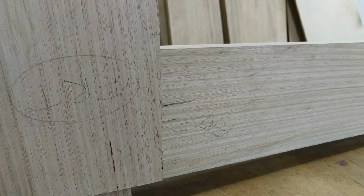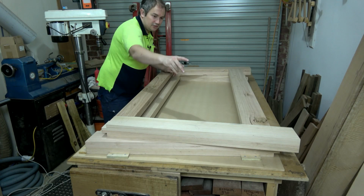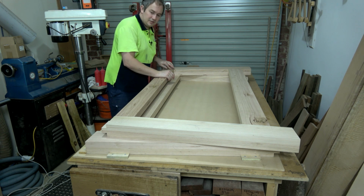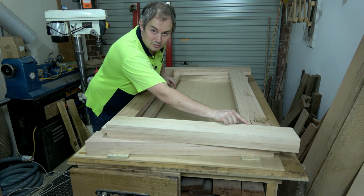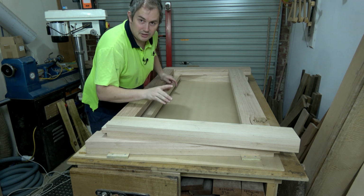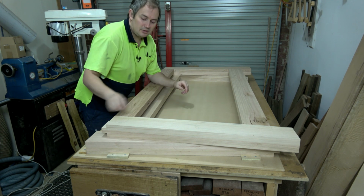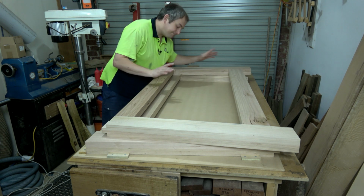But when you connect all 4 of them, you now need to turn 360 degrees. And so if this one is 90 degrees, this one is 90 degrees, this one is 90 degrees, and this one's 91 degrees, you're going to get a gap everywhere, because you have to account for that extra 1 degree somewhere. And so that'll open up gaps on the outside corners.